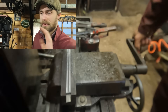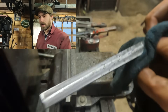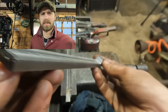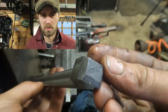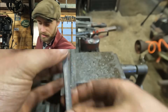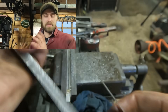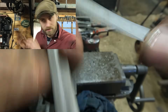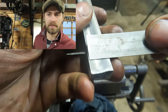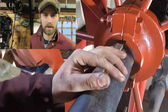I just want to cut in here and say I'm not happy with that finish at all — I was hoping for better. The steel is very tough and not readily machinable. Flood coolant would probably help; my machine does have a coolant pump which is belt driven, but I haven't set it up yet — it needs a separate countershaft and it's quite involved. Maybe this is a good time to do it. I should probably get on with that at some point.